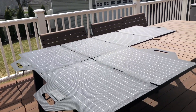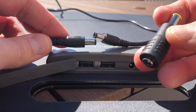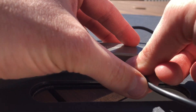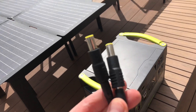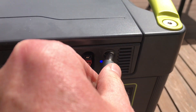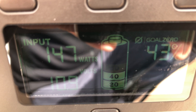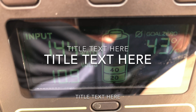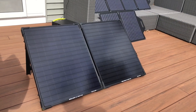It's a pretty cloudy day — mostly cloudy with pockets of sun — but I couldn't wait to fire this up. I grabbed the cable and the 8mm adapter to plug into my Yeti, and we're going to see what happens with the panels lying flat. Plugging the 120-watt and 60-watt panels into the MPPT inputs, we're getting 146 to 148 watts when the sun is as clear as possible — surprisingly good for two panels rated at 180 watts combined, which works out to about 81% of rated capacity.